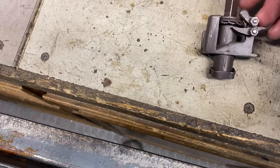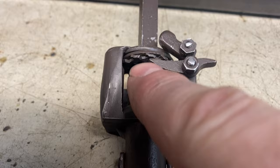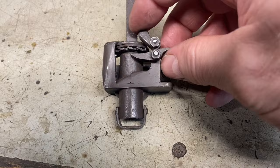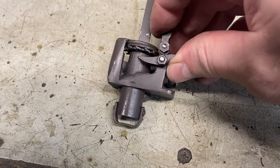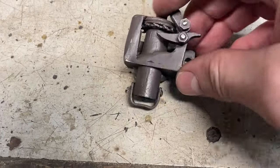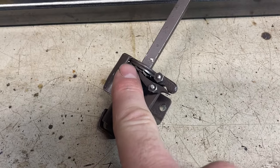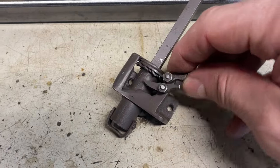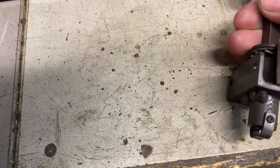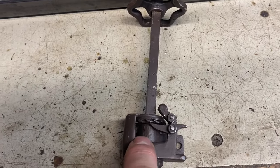I also wanted it to look like it was functional, so I've got a serrated lock washer as my ratcheting mechanism. And then I made these little pawl and the little weight here that keep it on, just out of scrap material. This weight would flip over like that and it puts pressure on the end of the pawl, then that engages. When you want to kick off the handbrake, you flip this to the other side and crank this backward just a little bit. The function of this would be to wind up on a drum down here with a chain around it.